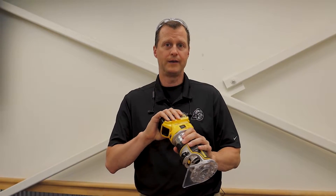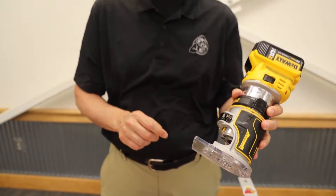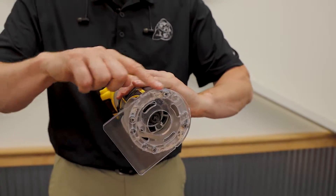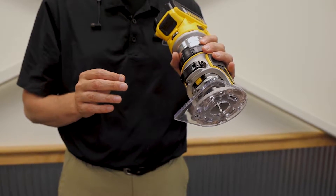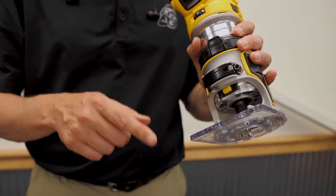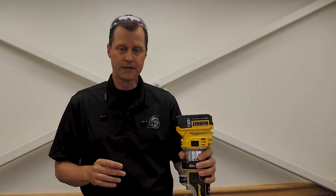Now there's something to pay attention to on the base, especially when you're going to be using this on a straight edge. When you look at the base it's a little bit differently shaped. You've got a round section here and a large flat section here. When you're going to use this router on a straight edge, most people think that the flat side is the side to use, and we're going to do a quick demonstration using this side — a couple inches into our cut my hand is going to move.